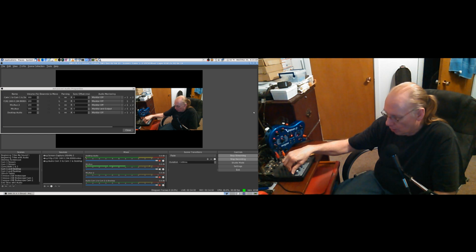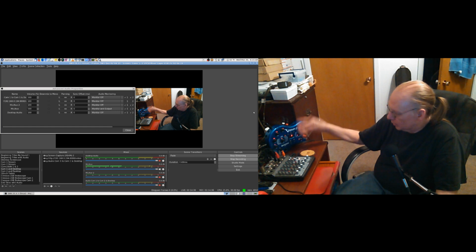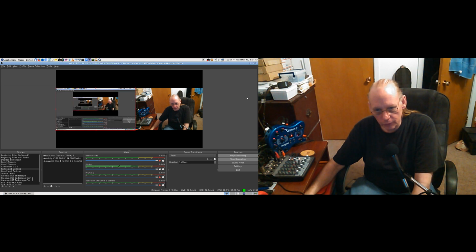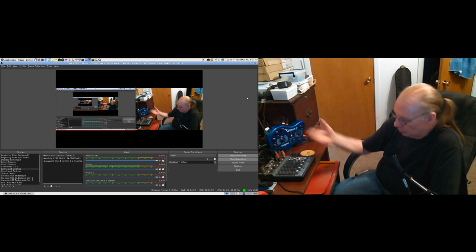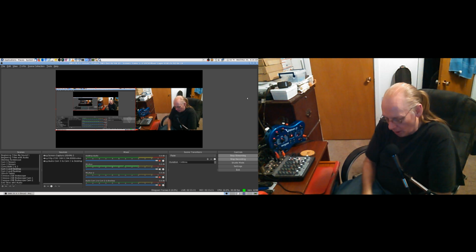Yeah, so it's the Vamp doing it. And like I said, I checked the cable, so there's still the possibility that the cable coming from the Vamp, which one is it? This one, to the computer is causing that. Very possible because it's a 1/4 inch TRS on that other end, which works as stereo, but of course the computer has 3.5 millimeters, so I had to add another converter, so it's this long, and it's been dangling. There's nothing to support it or anything.